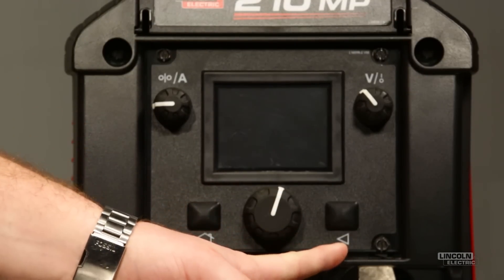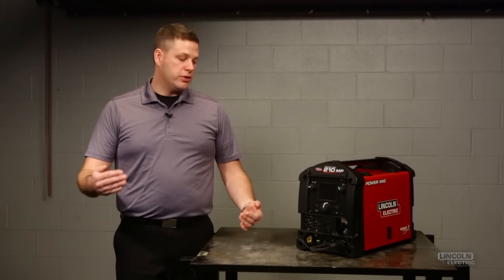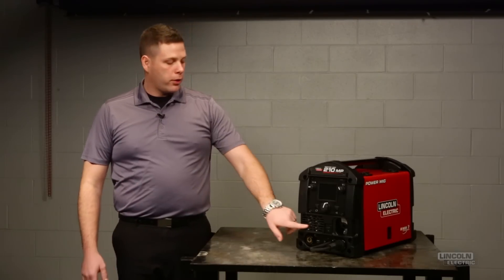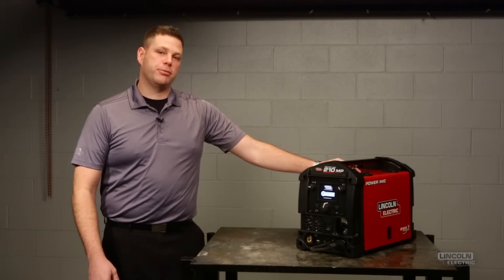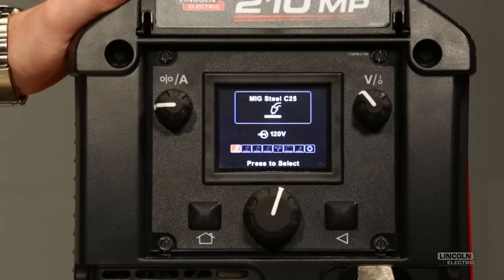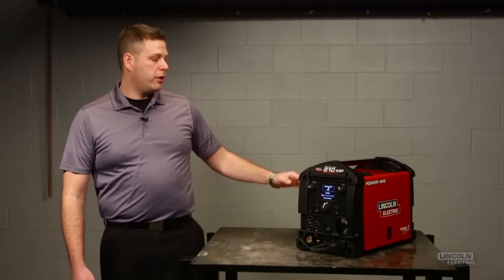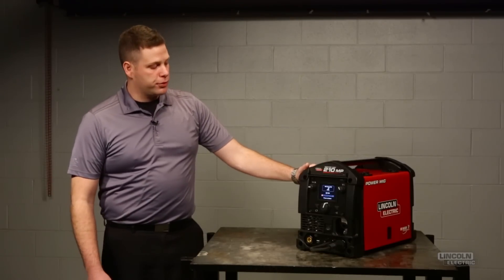On the bottom right, we've got the back arrow. Anytime you navigate through this step-by-step user interface, you can take a step back and make adjustments based on what you're welding. We're going to go ahead and turn the machine on and talk a little bit more about some of the adjustments we can make both while welding and prior to welding. You'll notice the machine intuitively recognizes that it's currently plugged into 120 volt input. Whether you're plugged into 120 or 230, the machine itself will sense that and adjust based on what kind of input voltage you have.